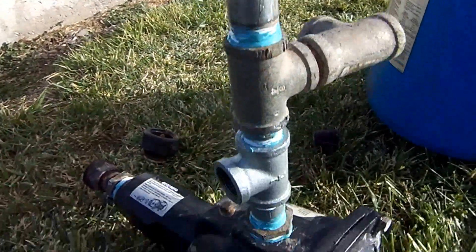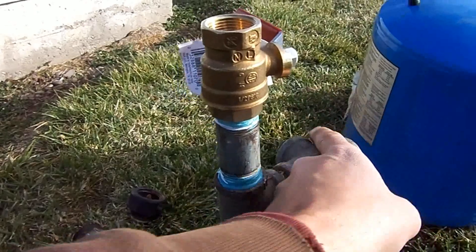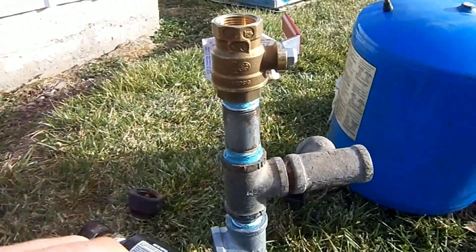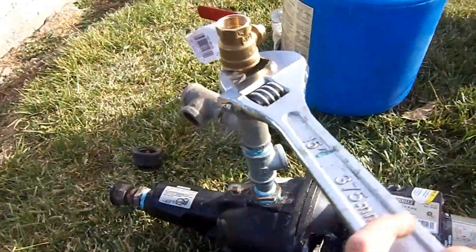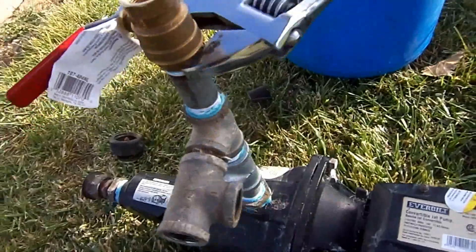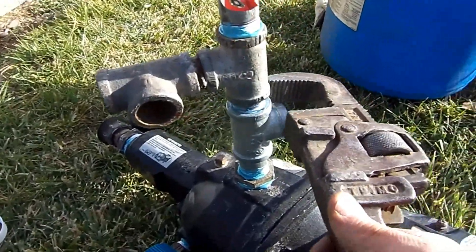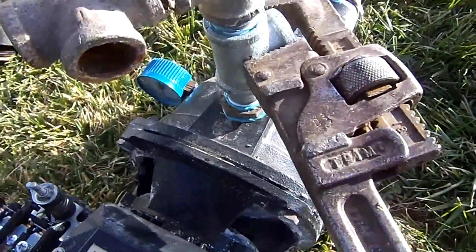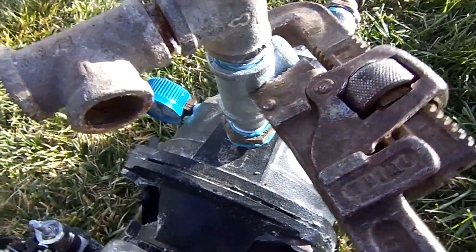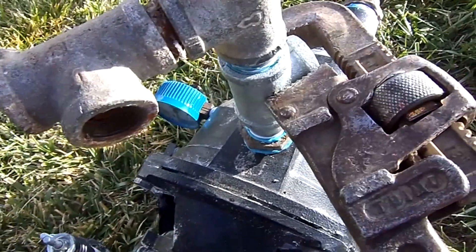A lot of times what I do when I'm getting ready to tighten these down: I have my pieces ready and I'll take the wrench and actually start from the top and spin it all the way over until I get to where I have to get things lined up. Then when things get tight, that's when I'll start tightening them on the lower end. Don't be afraid to bite down on them — these have to be pretty darn tight to seal up good. Get it to where you think it's really close and then try to get one more turn, or part of a turn.